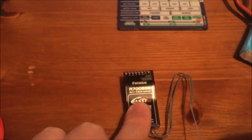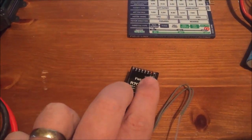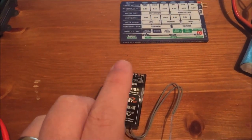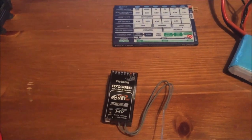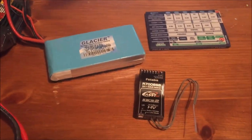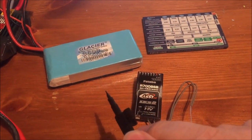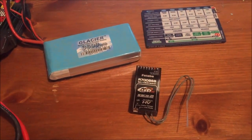The first thing you have to do is — most of these receivers out of the box come in mode A or mode 1, which only has one of the SBUS ports turned on. To use SBUS with my flybarless system and then SBUS2 for telemetry, I have to set this receiver to mode B. That's actually not a very difficult process. It just requires a battery and one of the trusty Futaba pokers. On the end of this receiver is a little button right here.